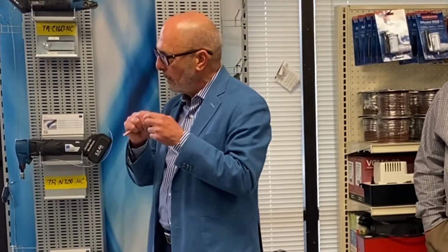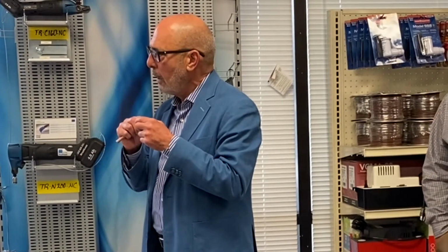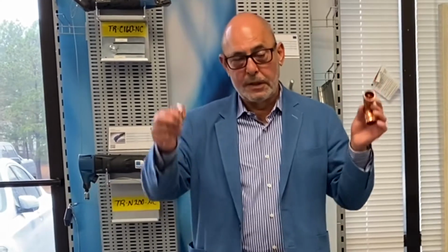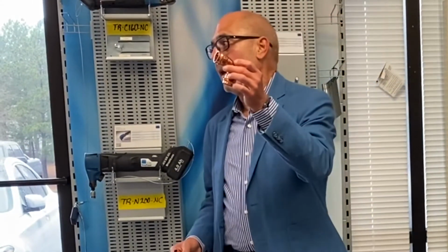And the reason is those cracks on the piping, and they are microscopic cracks on the copper, deforming the whole fitting. The other difference on this is we do long radius elbows in anything we do versus a short radius elbows. And in refrigerants, this is what you need, because having a short radius is going to give you a loss of pressure, loss of efficiency.